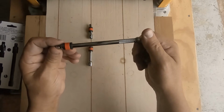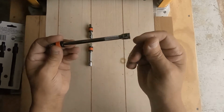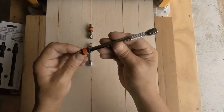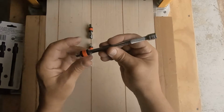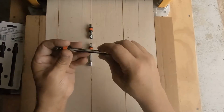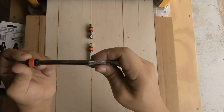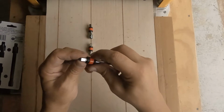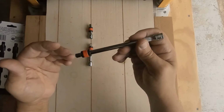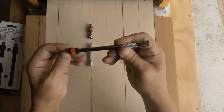And I remember back when I first started mechanicking, that was a very irritating thing to have, oil and grease on your fingers, and you're trying to turn an extension with this nice chromed, polished body, whether it's a socket or an extension, without something to grip on. You're getting frustrated. So you're trying to find a rag or whatever to grip onto it so that you can get enough grip to spin it. Well, they finally figured out that putting knurling on this kind of stuff helps a lot. And that's an extra process in the manufacturing of it, so that's added time that they've had to perform to give you a product that's more user friendly.